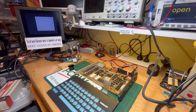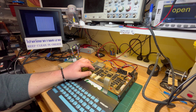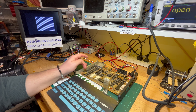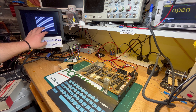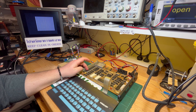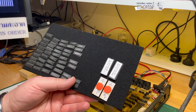You can see I've got no ROMs and we get the same pattern. I have tried putting in a Soviet test ROM that tests the memory, and I do get garbage on the screen — I don't even get the test routine. So there may still be an issue with one of the DRAMs. But interestingly, I have tried these two ROMs.